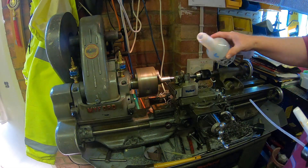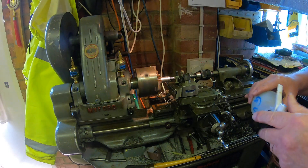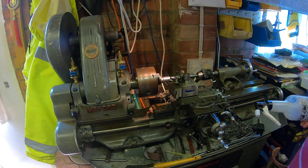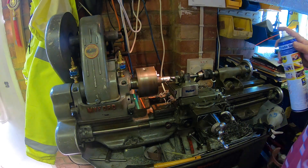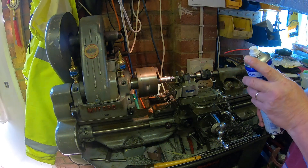I'll have to fill up my lubricant — I'm actually using nothing in there at the moment. Let me just stop and get some more. Never ever leave a lathe running and walk away — get some more lubricant. Bear with me. Okay, off we go again. Just a bit more lubricant on — I use WD-40, rightly or wrongly, but it seems to do the trick. Of course it's nice and easy to use with a spray.